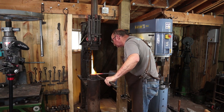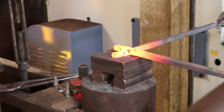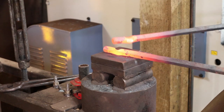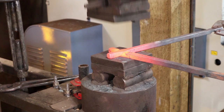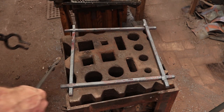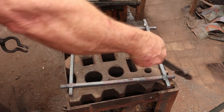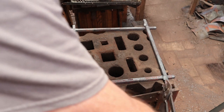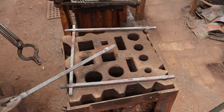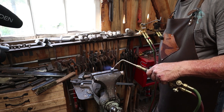Try to get the center-punch marks lined up so everything's symmetrical — that's all there is to it. I'm just going to set these back in position. We know we've got all the joints going the right direction. The next step is to do the little upsets on the end that I mentioned earlier. I'm going to take one bar at a time and use the torch to heat just the end and upset it in the vise.